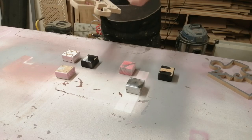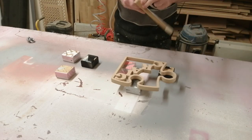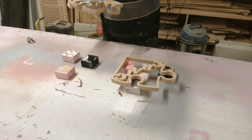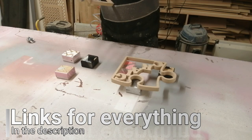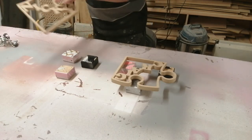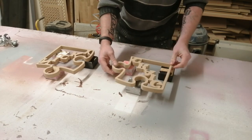So usually after peeling the paper off, you'd want to sand it before painting, but I sanded the items before attaching the pattern to the wood, and I use a number 3 scroll reverse skip tooth blade from Pegasus. That's a mouthful. With these blades, you end up with a really fine finish, and there's no tear out on the back, even with MDF.